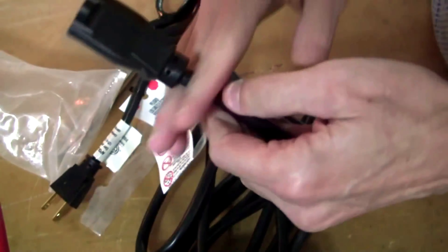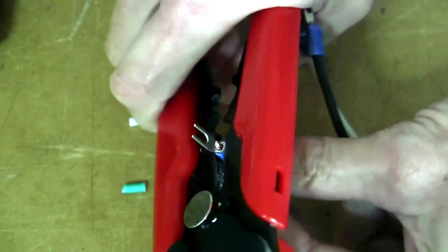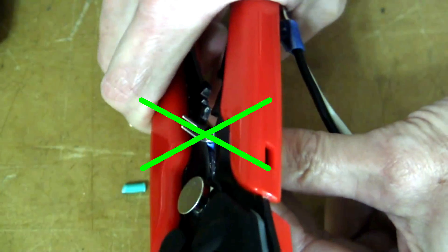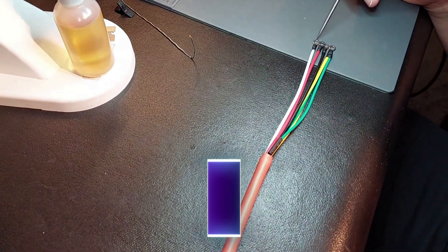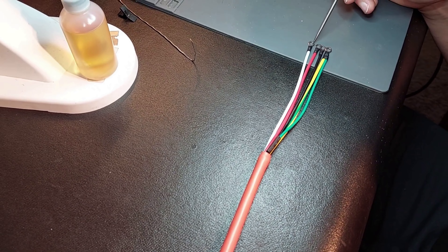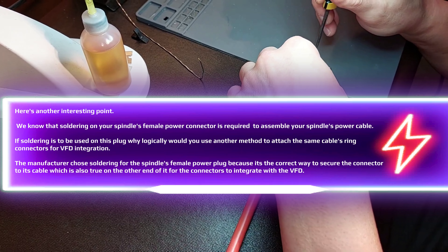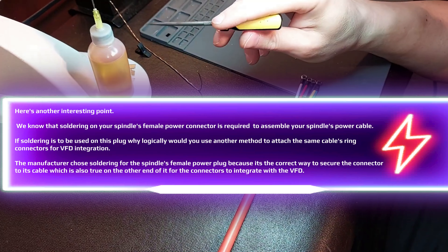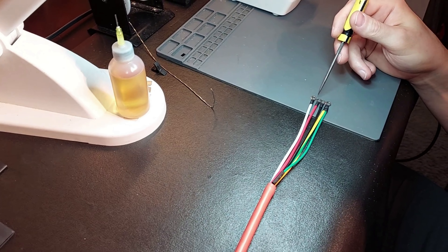He's installing fork connectors to integrate into the VFD's power terminal block, which is a definitive no-no for safety — it could lead to a catastrophic failure. Ring connectors do not pull out. Once attached, the screw goes through the center, and if you tried to pull it out you'd literally have to destroy each lead because these are done with solder and flux. The solder is Kester number 44 and the flux is Kester 186 RMA — the best in the industry. That is the proper way to do these cables so that we have proper safety implemented.